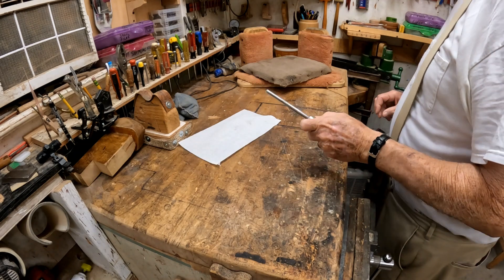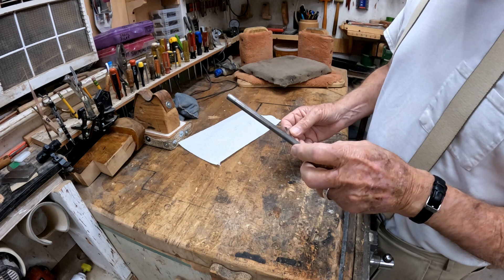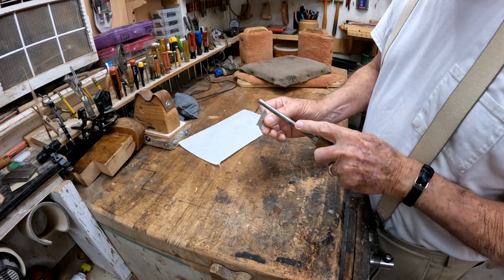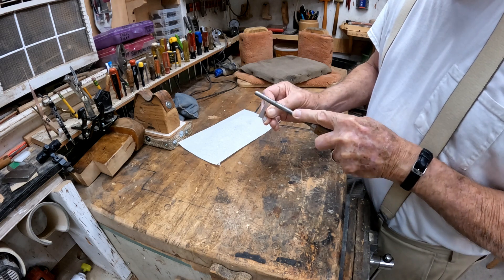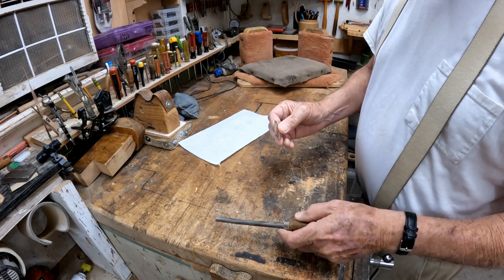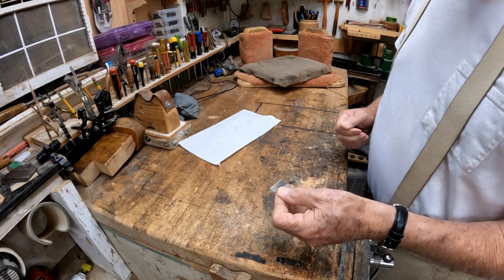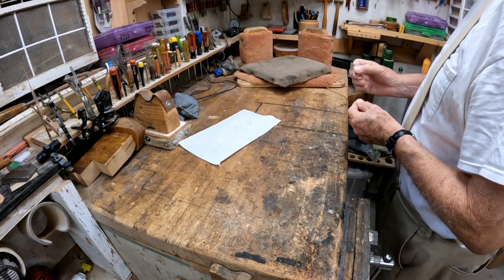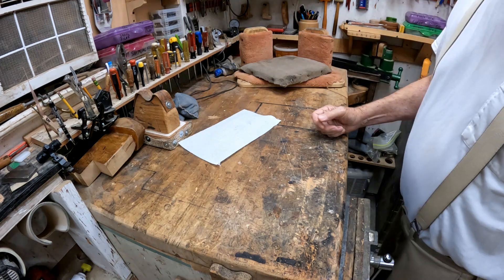You can turn a hook on these razor blades. This is a burnishing tool and you can mount it in a vice or something and turn your little hook on it. I think I saw Dan Erlewine just hitting it on the edge of a bandsaw or some cast iron thing, but if you turn your little hook on it, it makes it cut a little bit better. Same way with those scrapers.